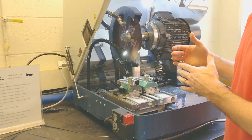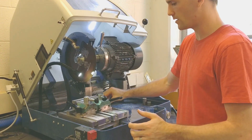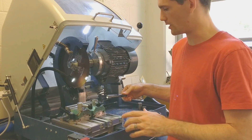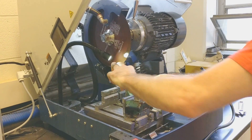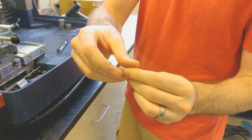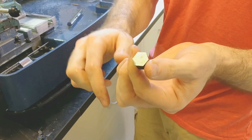If you want to cut many pieces from the same stock, take off the quick releases, move the piece over a little bit, tighten them, and do it again. If you're just finishing, loosen both of the black jaws and pull the piece out. If you're going to mount this afterward, you'll want to grind off any little burrs that exist on the piece.